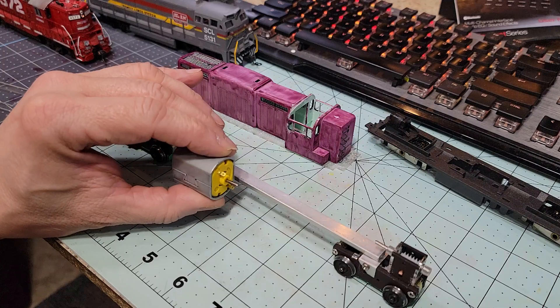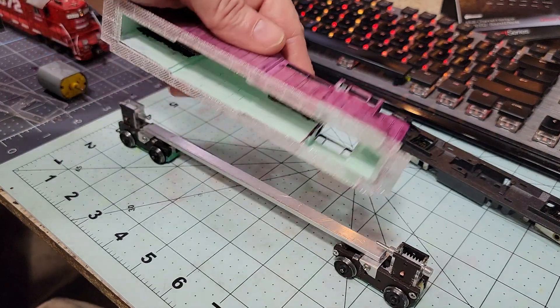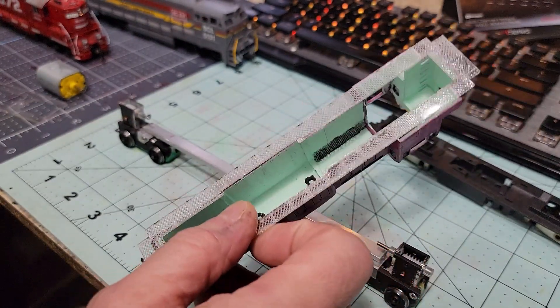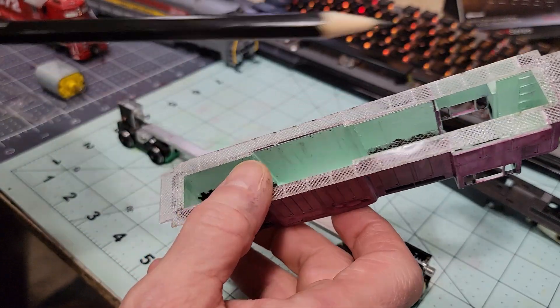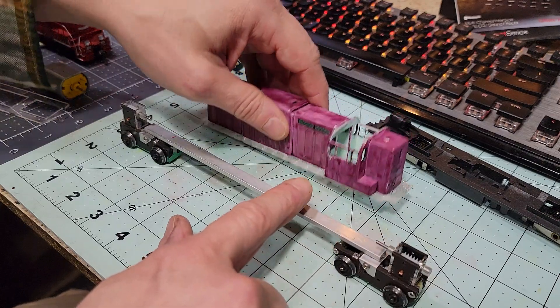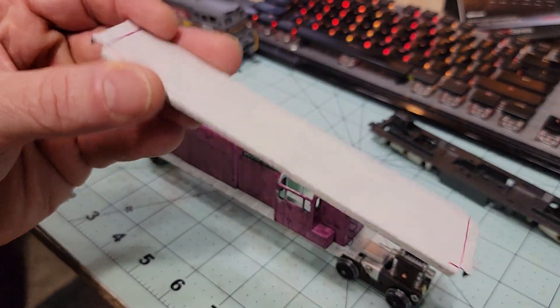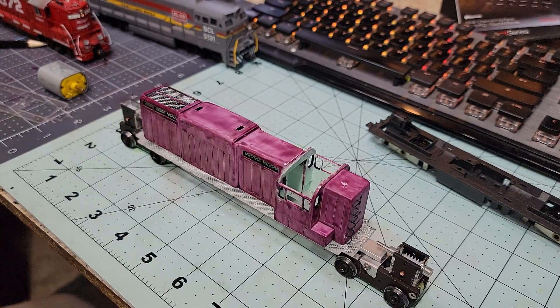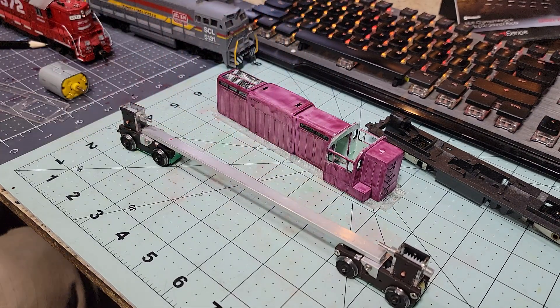We need to do something similar but get around the motor so it's level, and it's got to fit in the negative space — inside here. There are a couple of ways to do that: one is adding things to the inside that set the height, which is kind of where we're leaning; or we bond something to the under frame that this sets down on, like a shelf. We've already determined we can JB weld stuff to give it strength and then mill it. We've got to figure out a way to make something in the negative space and get our pintles in place.